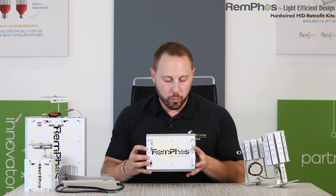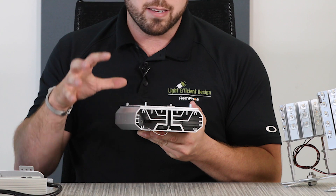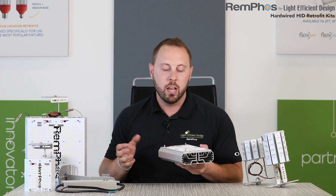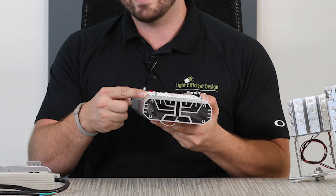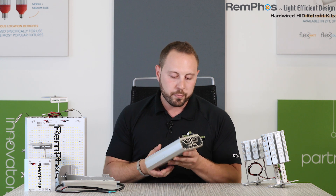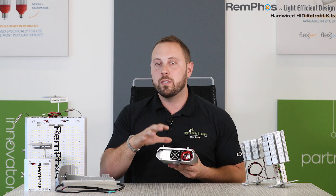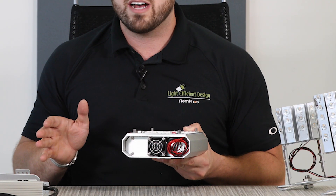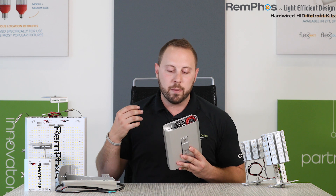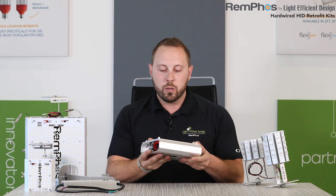Looking at our LED module, we have a really strong, rigid assembly. This is an extruded aluminum assembly with a lot of heat sinking to maximize thermal performance — that's why many of these units are over 160 lumens per watt, super high efficiency. We use a really thick metal-core aluminum board, again to get the heat from the LED down to the heat sink as efficiently as possible. These units also have active cooling, very similar to our Light Efficient Design screw-in lamps. The fans are warranted for 100,000 hours, designed so you won't get gunk or bugs built up in them, and they have a magnetic levitating bearing so they'll last a long, long time without any worries.